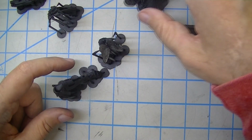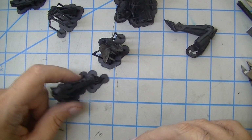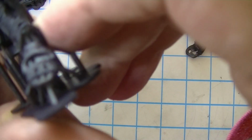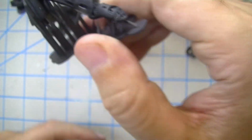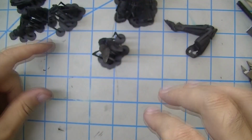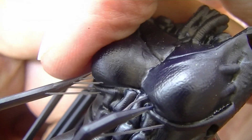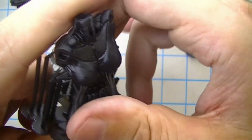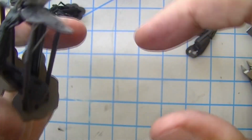So what I did is I told the software to find all the islands and add supports to all those, and then I went back and added some where I thought, just instinctively, I might need them. Like on the tip of the toe, right there, you can kind of see that underneath the bottom of the foot. I added some there, and this part also came out perfect. And you can see I don't have a lot of supports that I really have to deal with, so that's nice. I added some what you would call fan supports, actually on both batches, and that's where you're using what's called mini supports to create a little fan. These are probably a little too small because they got really wiggly right there, so I may need to thicken those up because they're probably not really doing much good.